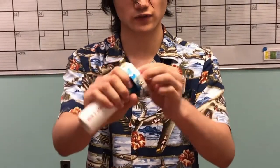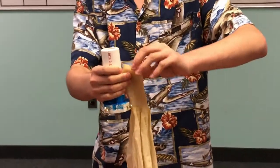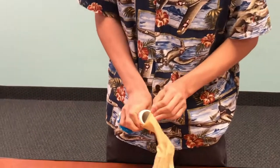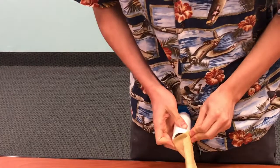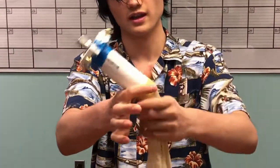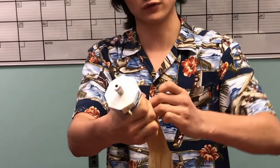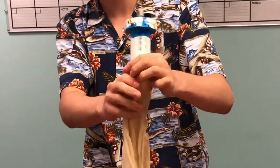This pressure fitting allows us to connect a 1/4-inch tube to the balloon. And the balloon neck slips over the tube like so. Oh, it's a little hard. So the balloon neck will fit over this pipe, and the diameters are very close, so it gets a good seal. There's a lot of friction here, and though it's pretty good, we're going to add some reinforcement in the mounting, like a zip tie or something, to make sure it stays put.